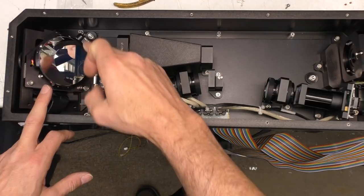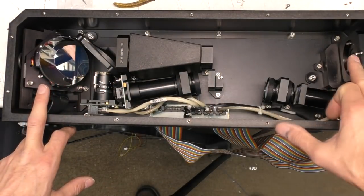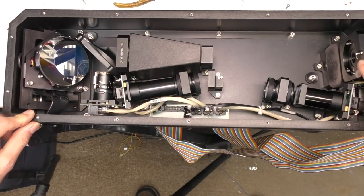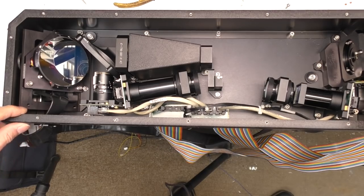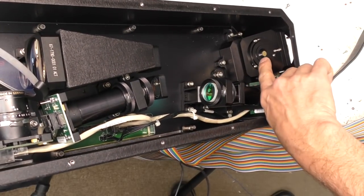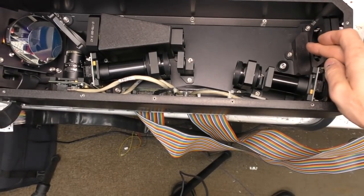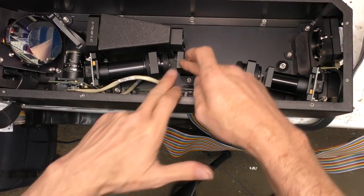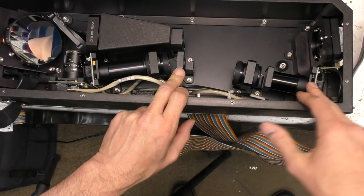The beam splitter sends one optical path through to this camera here, and the straight through path goes through a couple of lenses, bounces off this, which it turns out is an adaptive mirror, which can change its curvature based on the amount of power fed into the coil. I think it's similar to a speaker voice coil, and you can just see the mirror there, which I think is a fairly thin film, like a plastic film. So the image comes through here, bounces off this mirror, and then we have another beam splitter here. One image goes to this camera and the other image goes down to this one.